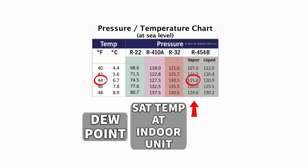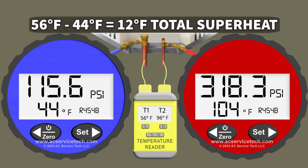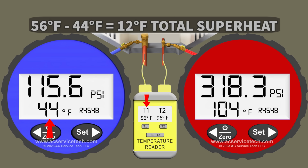And so we have 44 degrees. And now we measure the vapor line temperature of 56 degrees, so you take 56 minus 44, and we're left with 12 degrees of total superheat. So we know our metering device is doing a proper job, keeping it about 8 to 12 degrees of superheat.